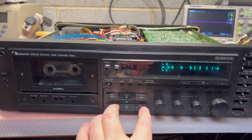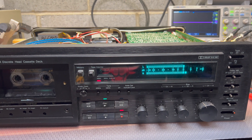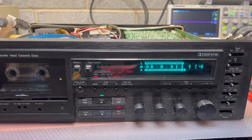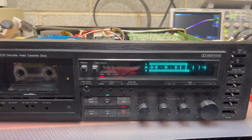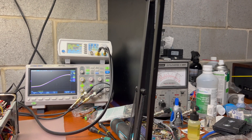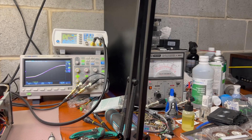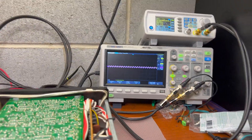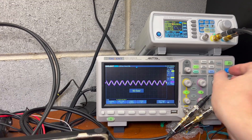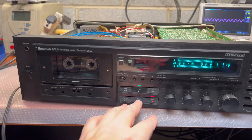I'm checking calibration - Type 1 tape, let's see how it will perform. It's calibrating. Done. Now let's record 400Hz - recording source and tape. I need to reduce the right channel a little bit. We recorded the internal tone. And now 15kHz. You may see here on source and tape it's calibrated well. I removed all the frequency correction circuitry, so now it works well.